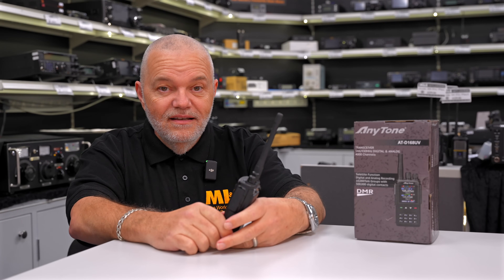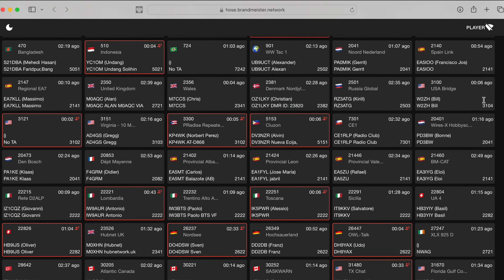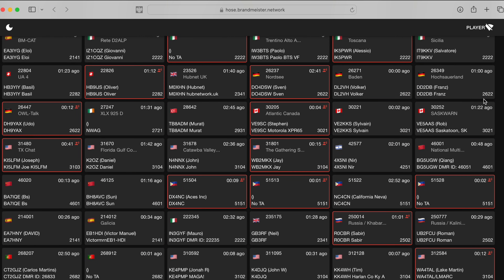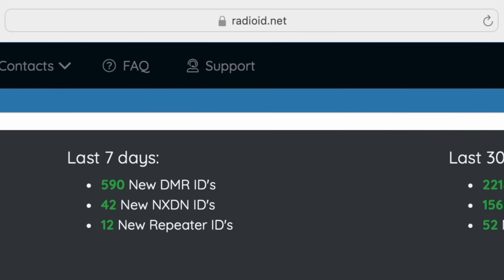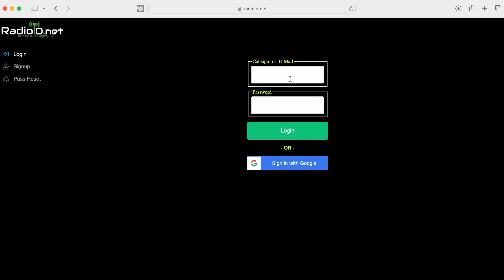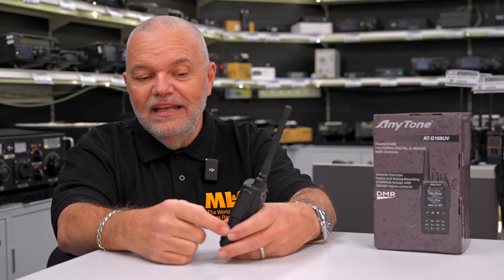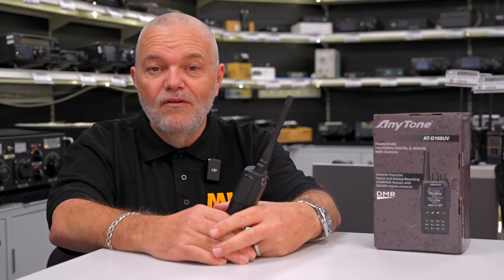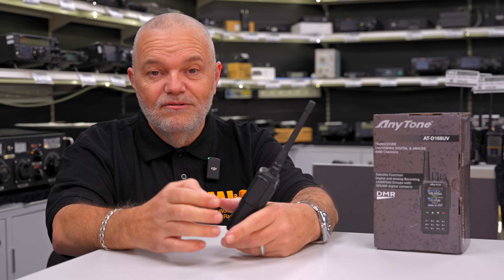And DMR — if you want to have a little listen to DMR to find out exactly what it sounds like, you can go over to Hoseline. We'll leave a link in the description so you can click that and go have a listen. Lots of rooms all over the world, conversations happening instantaneously all over the place. You can go and listen before you get involved if that's what you'd like to do. But what you do need to do is go and get registered at radioid.net. You have to be a licensed amateur radio operator and provide your license to get registered. Once you're registered, you can then start loading up your code plug, contact list, or database in your radio that will allow you to interact with some of these rooms and have direct contacts with some of your friends.